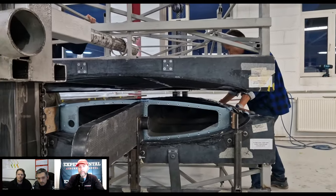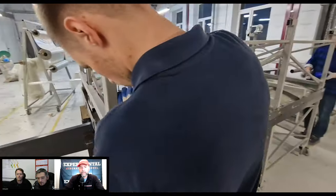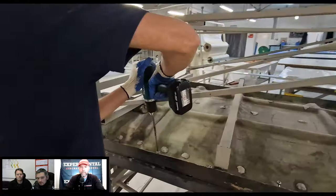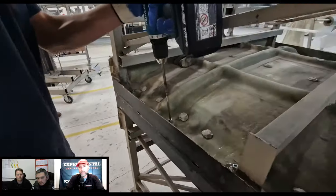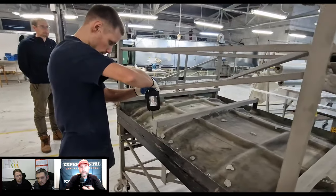So when you do a layup, obviously you're checking your chemicals, your chemistry as you're doing this. Do you have like a layup room, which is probably a dirty room? Do you roll it into an oven, if not to bake it, but just to control the temperature and humidity? Or what does that look like for you guys?